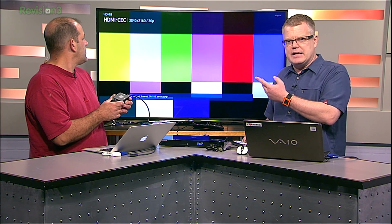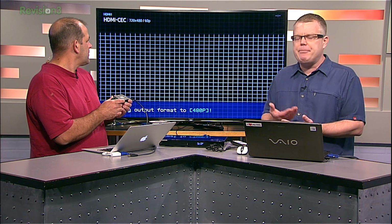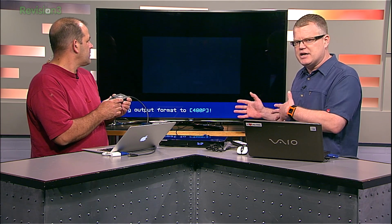Now, the big deal about a test pattern generator like that is that it's dynamic and controllable via USB. Now, if you're using a software package like CalMAN or ChromaPure or a few of the other popular test software packages out there for calibrating and testing display devices, this can tie right into it and be controlled through that software interface to further automate your setup and testing.